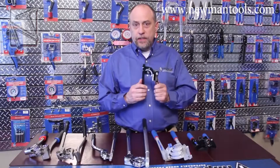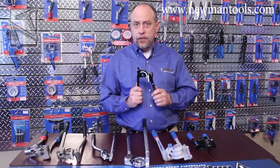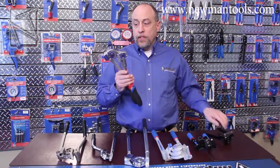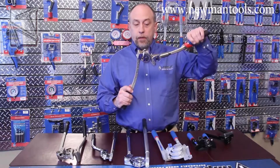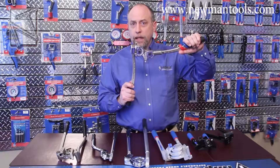You may need something as simple as this 368FH bender, which is a staple tool for the HVAC industry and plumbing, all the way over to this 664FH, which is a lot heavier duty and offers more features — like an articulating head that makes it more suitable for confined areas and where you might need a tighter bend radius.